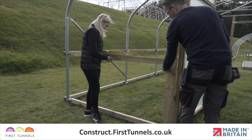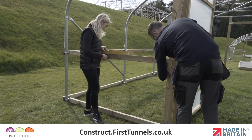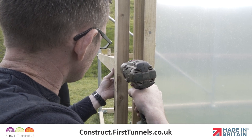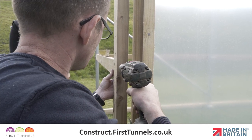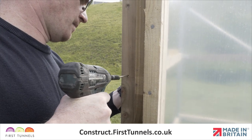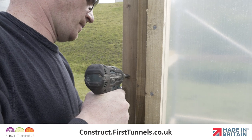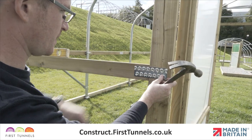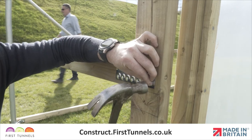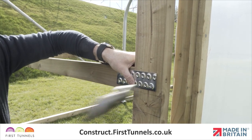Use the spirit level to make sure it is level to the doorpost and then use a 4mm timber drill bit to drill a pilot hole in the centre of the inside edge of the doorpost through into the corner rail. Screw a 150mm screw through the hole to secure together. Reinforce the joint from the doorpost to the side rail with a nail plate and square twisted nails. Nail plates are installed on both sides of the joint.